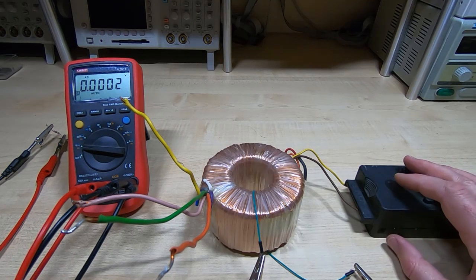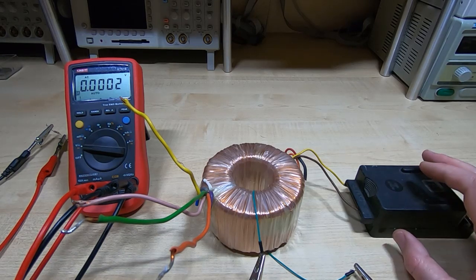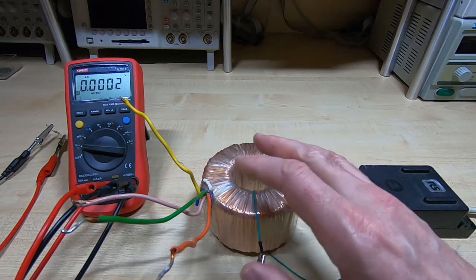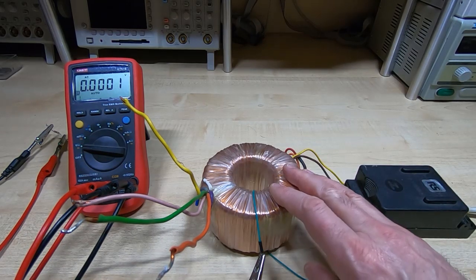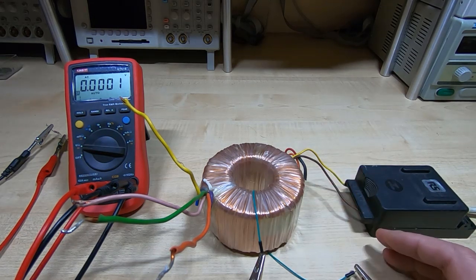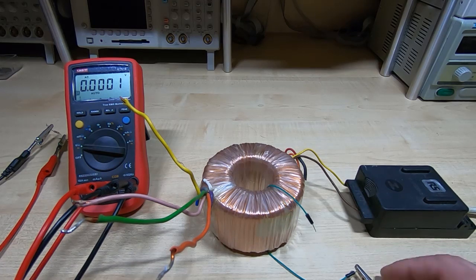At the beginning I said I'd like to encourage inventiveness and people to look at different ways of doing things. So I'm going to deviate from the standard approach. What you'd normally do is wind a 240 volt primary and a 48 volt secondary on each transformer. But because I know these cores are identical, I have another option — probably one you might not have seen before — and you do need to be very careful to get it right.